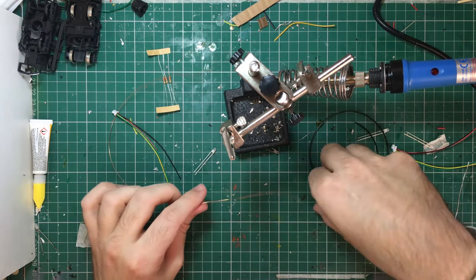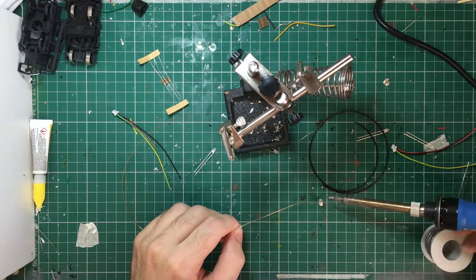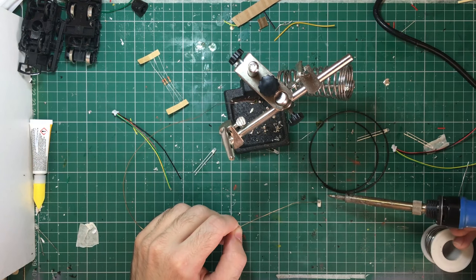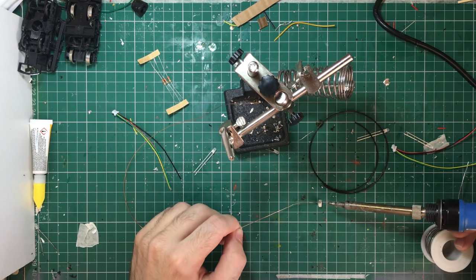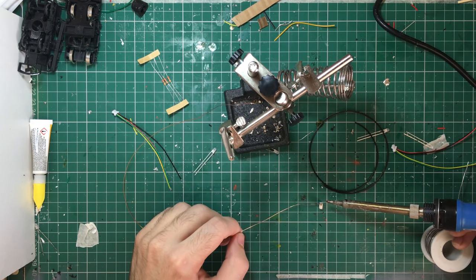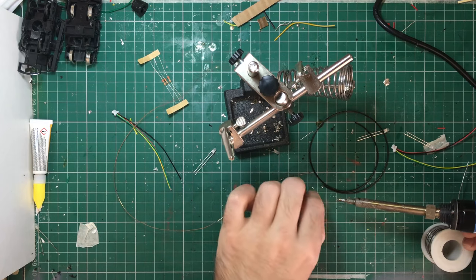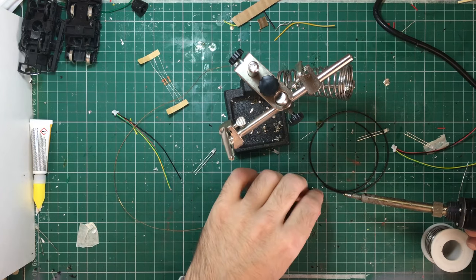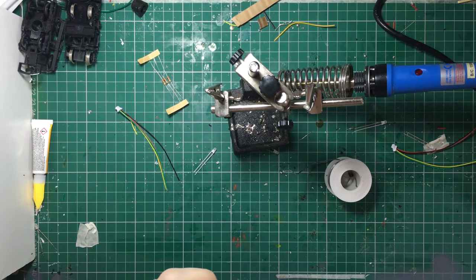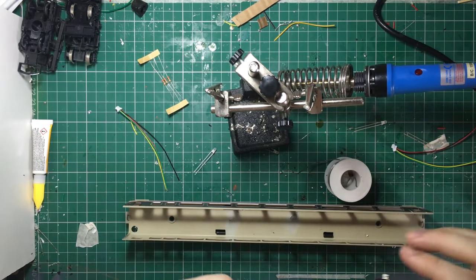In this case the red and the black will be going to the enameled wire, and the green and the yellow will be going to the black wire. At the other end I will connect the corresponding colours to the next fly lead. I'll be using the black from my LED light string and the red of the LED light string going from the enameled wire and the black going from the black. I'm having a bit of difficulty getting the solder to stick as the connections are tiny. Next time I'll try and get a two-pin and possibly a bigger pin set — it will just be so much easier than the four small pins.